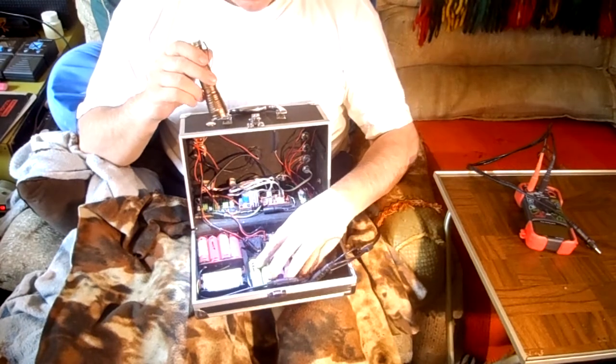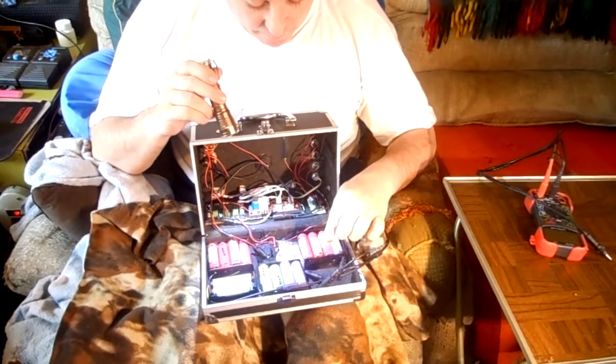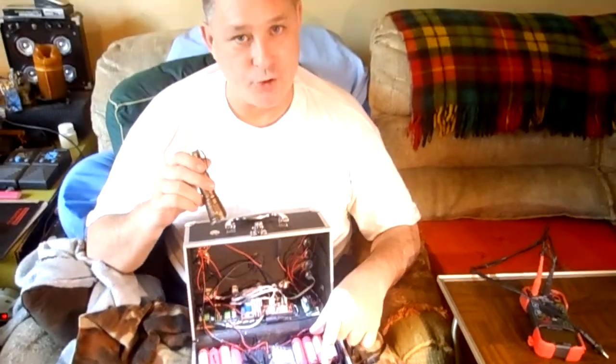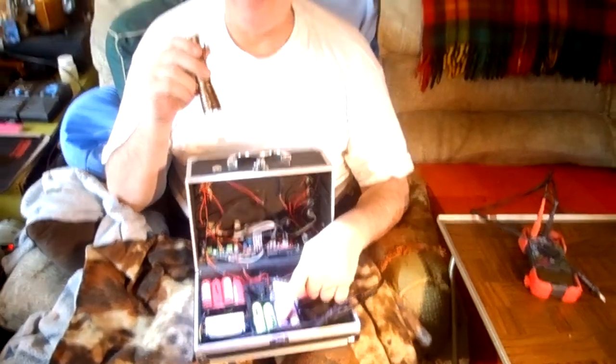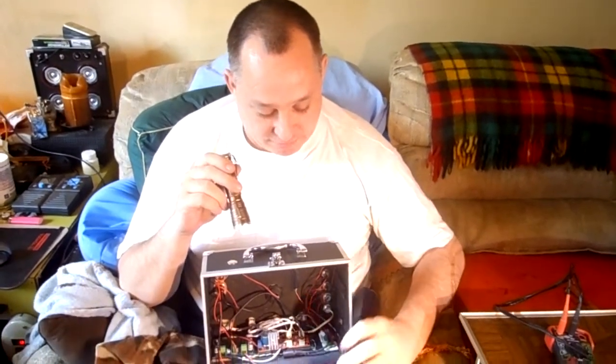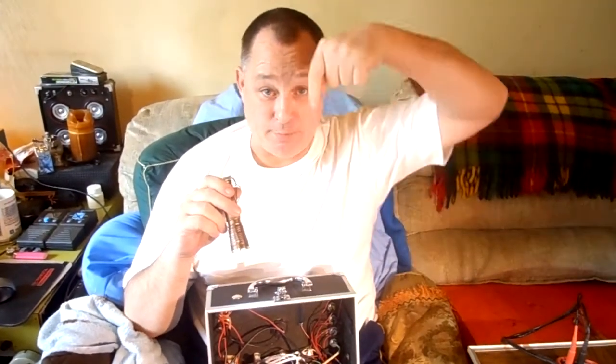If you're ordering these, the difference is the ones that are just metal bent over — they don't come with wire, you have to wire them yourself. You can use thicker wire that comes off a computer power supply or a lamp cable. The wire on the spring ones is really thin, and I had one that didn't make contact. Something was up with the positive — it's like a rivet they have in there, and it wasn't quite machined right. They're junky. So I would recommend you avoid the spring terminal 18650 holders and get the ones that just have a metal tab bent over, which terminates in a little pointy solder tab you can bend however you want.